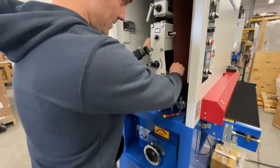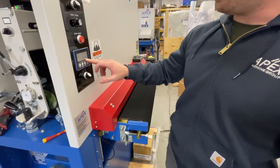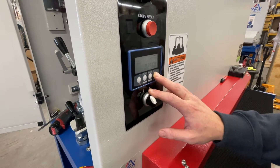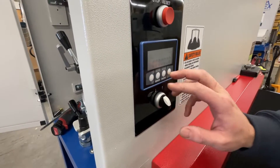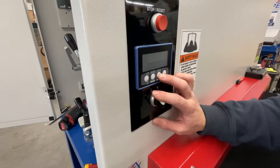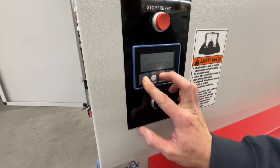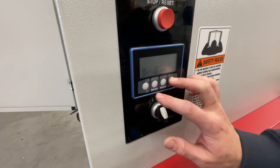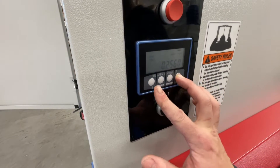That's pretty good — you can see it's pretty tight on there. Now we're going to come over here and change this to the height of the part that we just did the scratch test on. Hold enter, and now it says origin. As soon as it says origin, you press enter again. These are your left and right, and this is the up and down value. So we're going to set this to the height of our part: 0.235. Then press enter, and then press clear. This will bring us back to this screen. Now to load that origin value, you're going to hold enter and press clear.